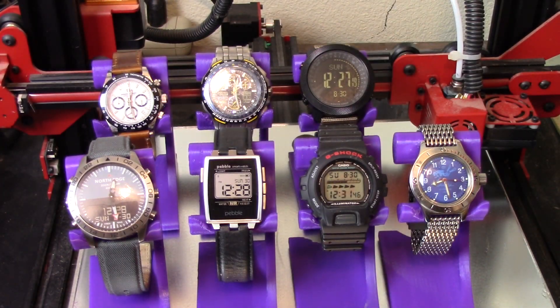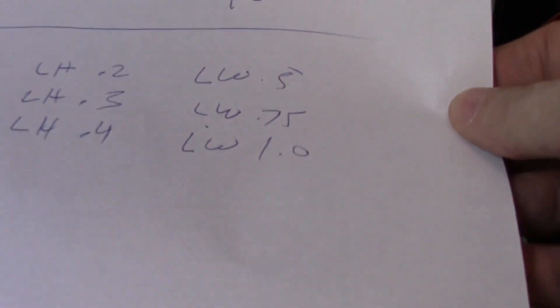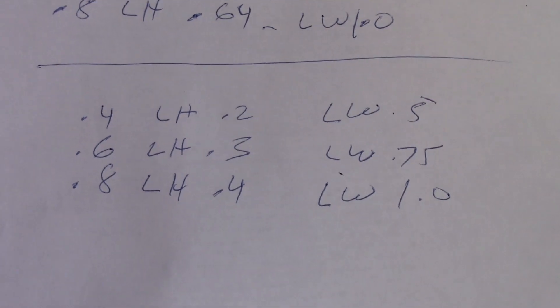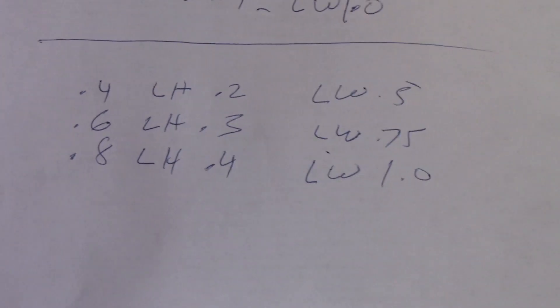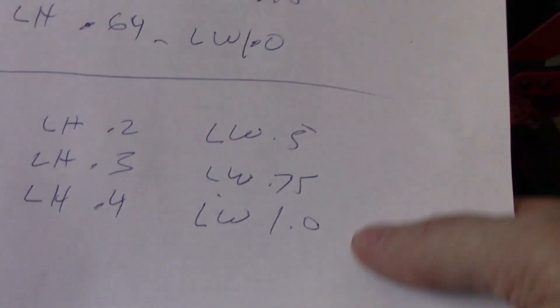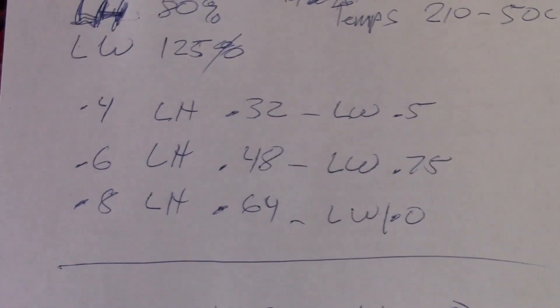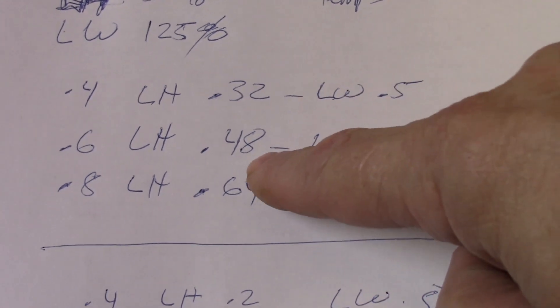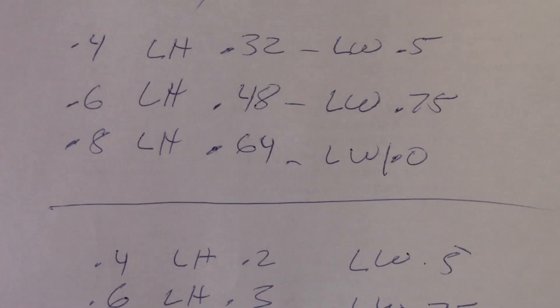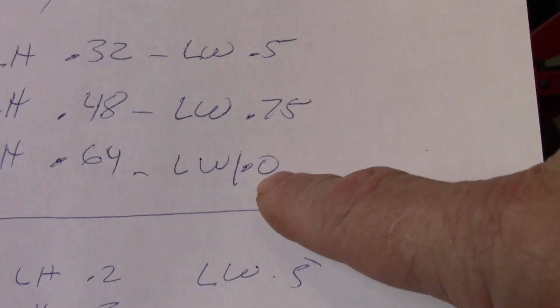Here's how I intended to test this: I'm not going to go below 0.4mm or up to 1.0mm nozzle size. My intention was to start like a lot of people do — 0.4 nozzle at 0.2 layer height — then go to 0.3 on the 0.6 nozzle and 0.4 on the 0.8 nozzle. For line width I've always had best luck with 125 percent of the nozzle diameter. I'm then going up to what I feel is the maximum layer height: 0.32 on the 0.4 nozzle, 0.48 on the 0.6, and 0.64 on the 0.8 nozzle — which puts line width at one millimeter on the 0.8.